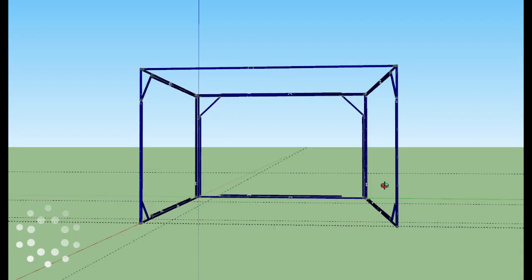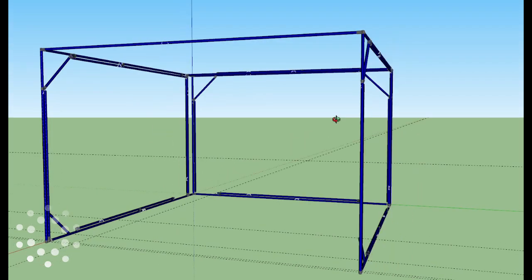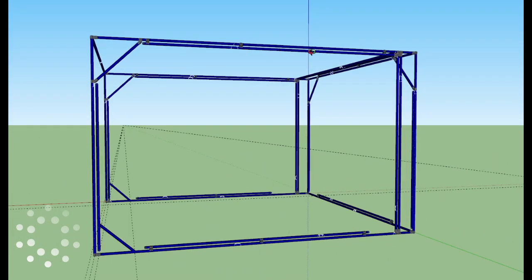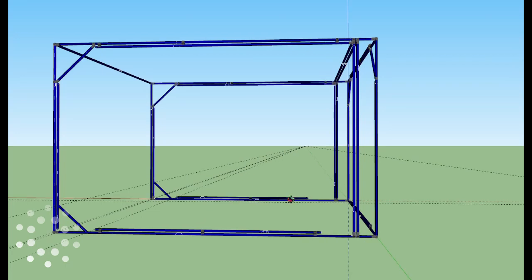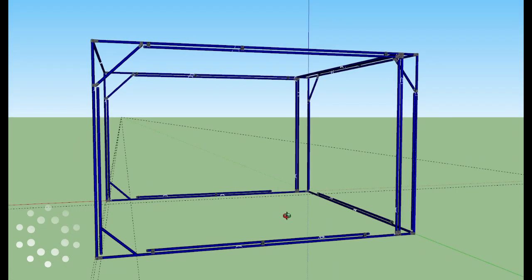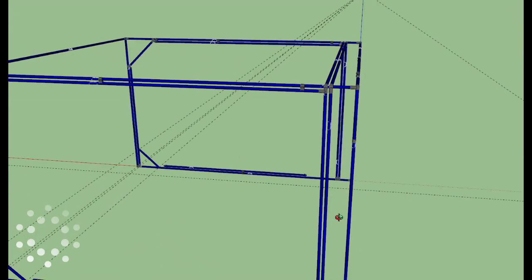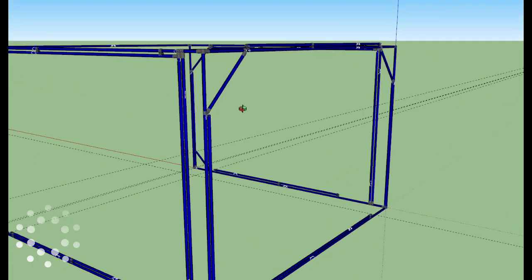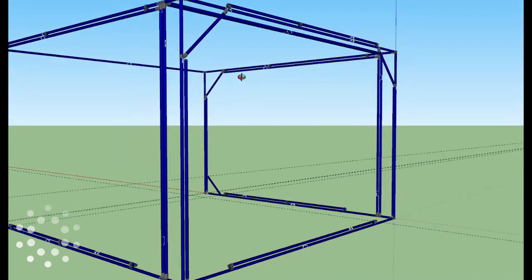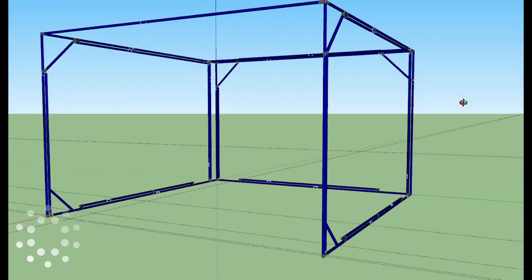All of this has led me to designing this steel structure that's capable of a 15-foot span without sagging or bending. At the side you can see the double reinforced top and bottom with some 45-degree corner bracing that gives it that strength and rigidity. There would be a side curtain here, but you don't want anything potentially behind the curtain where the ball could hit and come ricocheting back. That's why it's open and clear. You've got a double reinforced screen that is offset from the back wall by just enough to protect anybody walking by the back, or from the ball pushing the screen and hitting a wall behind there.